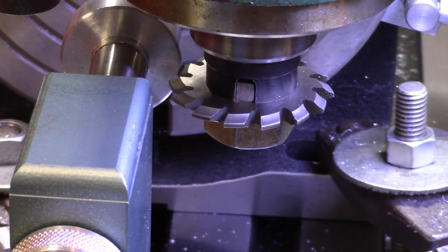I've got her set up here — I hope correctly. I had to go back and do it over again because the first time around I put the wrong cutter on there. I'd been cheap enough to use the same piece of paper twice and thought I could read it, but I couldn't. I thought I was doing 40 teeth, and I said wait a minute, this is an awful lot smaller gear than the last one I did with 40 teeth. I went back and looked and really it's supposed to be 24, which meant I had to swap out the cutter. I already had the cutter on there and had it set to the proper height, but luckily my brain worked a little bit there right at the last minute.